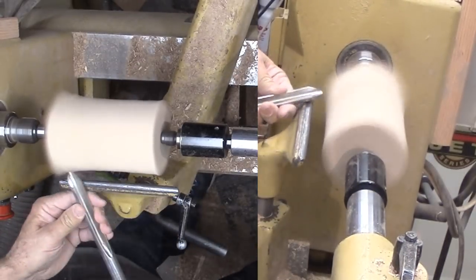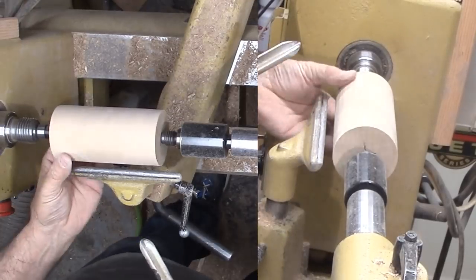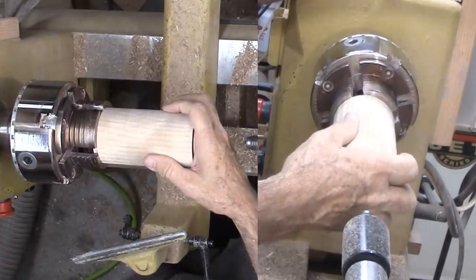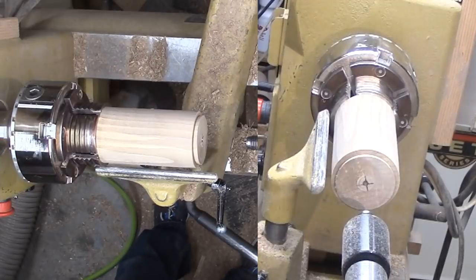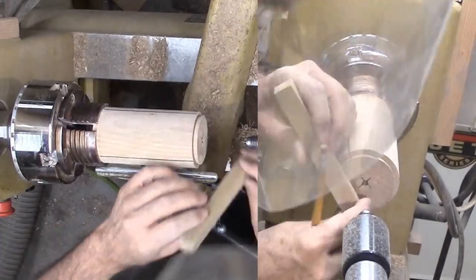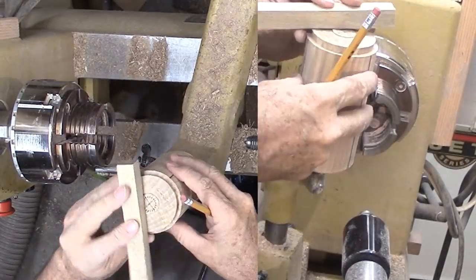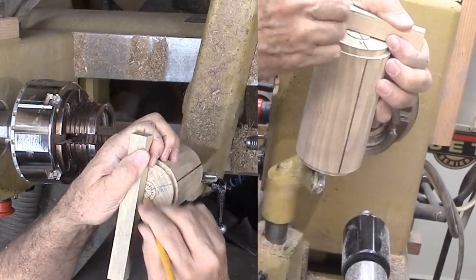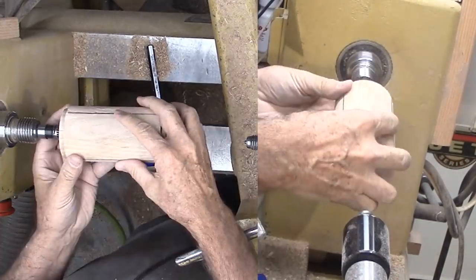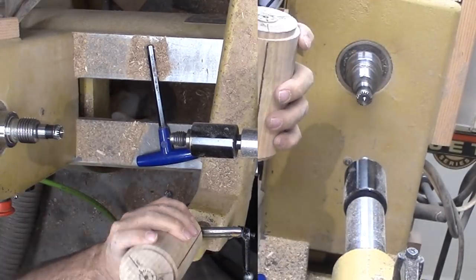For this project, I'm using some wood harvested from a gum tree in my yard — some call this urban forestry. Although I treated it, it has been too long and the wood is in rough shape. After roughing it with my large bowl gouge, I'm cutting tenons with my skew. Now I need to mark three lines 120 degrees apart on the cylinder. I have to use my phone flashlight to see the index markers on the back of my chuck, then extend the lines to the center on each end and number each line on both ends. I have to pay attention to not mix up the numbers. I reverse the cylinder to get good center marks on both ends — I'll use these to gauge distance from center.